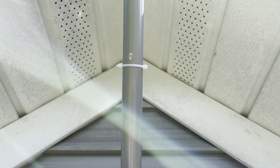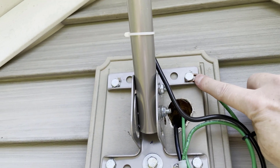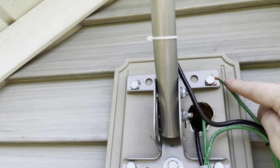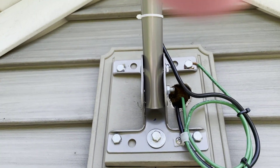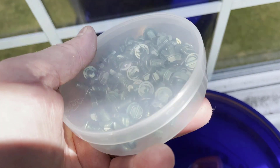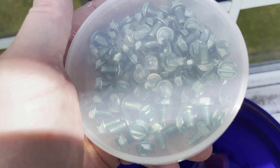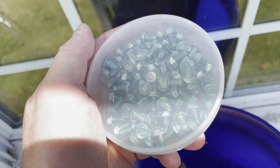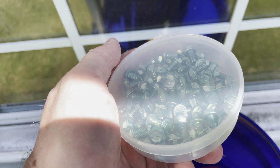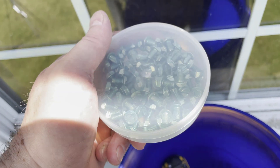There's not going to be a lot of moisture coming down this — it's going to drip, but it's not going to be huge. I wanted to show you what not to do, so don't do that. I'll back that screw out and take this wire off. I'm going to drill a hole on the side of it with a 3-millimeter drill bit, which is what I typically use for these screws. These are proper ground screws — I'll leave the link to this product at heliumstreet.com. It's the same ground screw I use for all my installations.